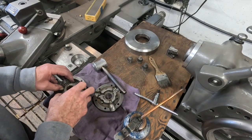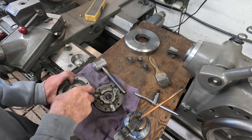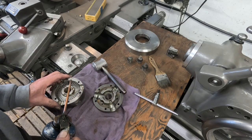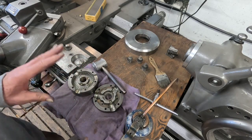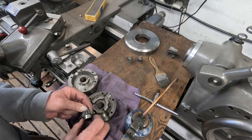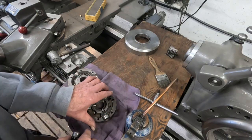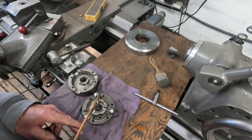I did have to tap on it a little bit with a lead hammer — this is like the world's tightest scroll I've ever seen, but it's in there and I can move it. Put a little drop of way oil on it and it should be fine. I stoned these surfaces and we'll get the pinions in here, all working freely, and get them a little oil.